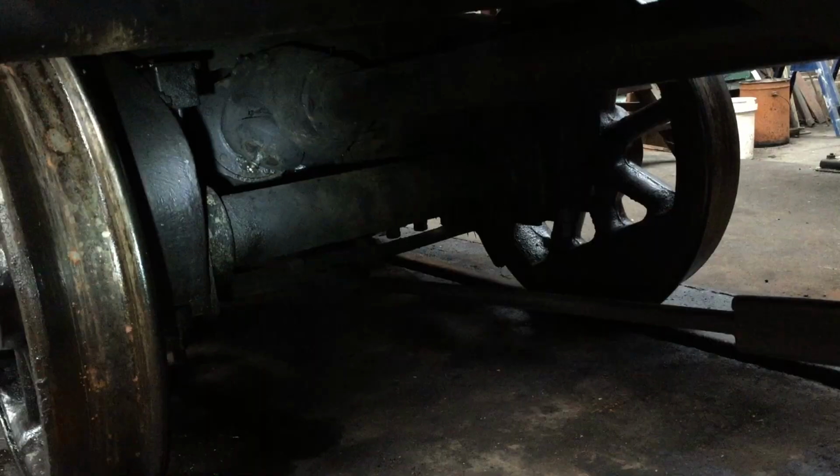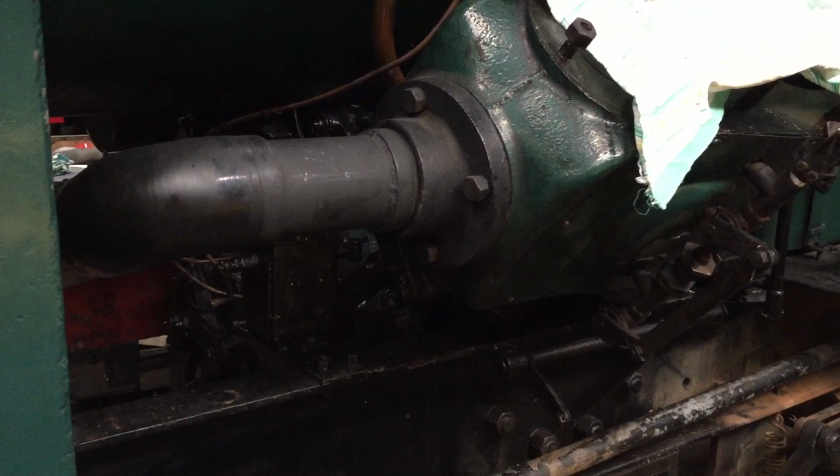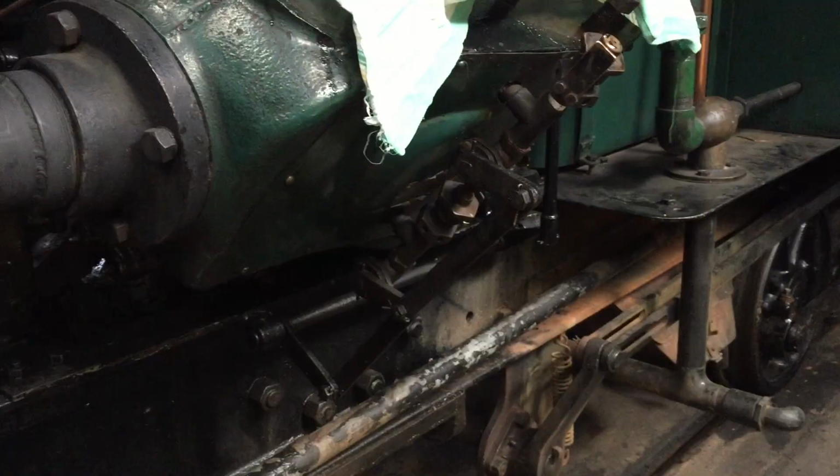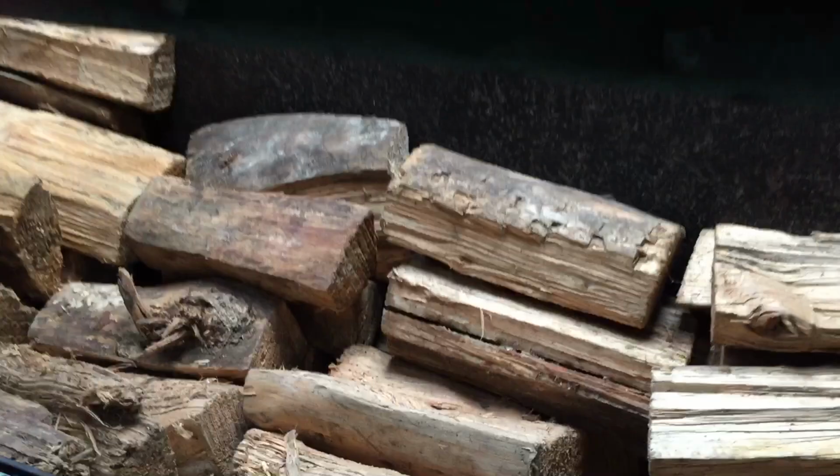So the bogies are just about pure Heisler. The engine is not at all. It's fitted with pannier tanks, or side tanks, which has allowed the engine to be disposed exactly halfway between bogie centres. Unlike a Heisler, where the engine is further forward and the water and fuel is located at the rear of the locomotive. In this case, there's just a fuel bunker.